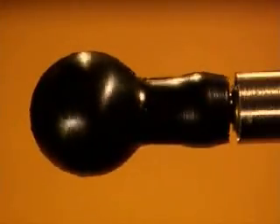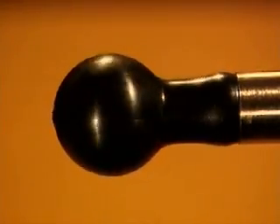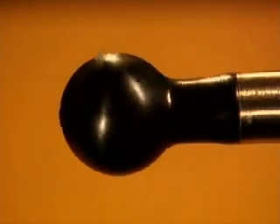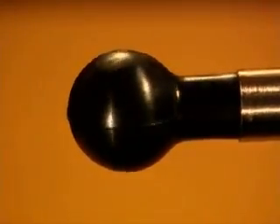This stop must be distinct. If not, there is debris in the nipple threads — in this case, unscrew the nipple again and clean the threads. It's very important that the neck of the balloon is pulled completely into the balloon holder to be properly secured.